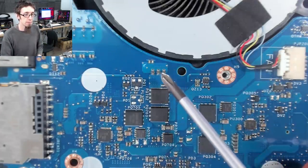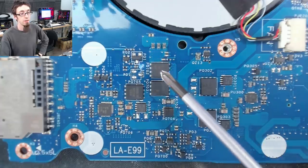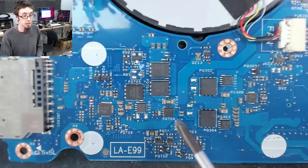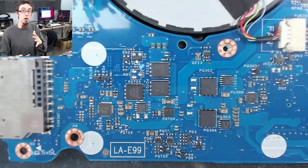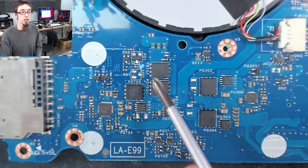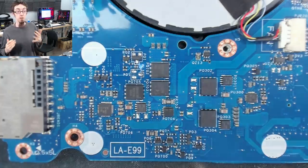So they're getting smoothed out by those, and then they're going into these two MOSFETs. This is our inrush limiter. This is what I was looking for. So these two MOSFETs are essentially forming a digital switch, which allows the laptop's power management IC, which is probably this guy here, to switch off the incoming power. So if this guy goes, I don't like what's going on here, it switches off these MOSFETs and prevents power going into the laptop. And that prevents any damage in a faulty situation.